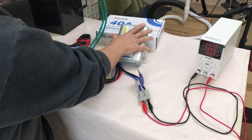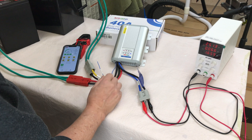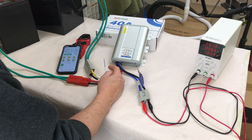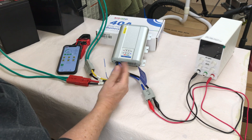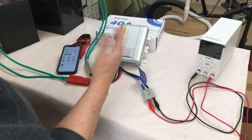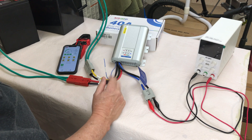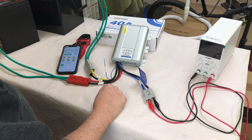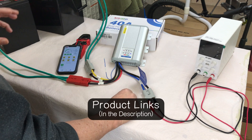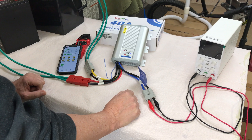Very cool device. I think it's very well built and very simple to connect and use. You just have to remember you're going to have to come up with your own wiring — that's probably the most difficult part. But they do give you the Anderson connectors; you'll just need a crimper, the wire, and some fuses. I think it would be real handy, and in some cases you wouldn't even have to have solar. Charge your house battery while you're traveling and your battery is topped off when you arrive. And if you had a couple of cloudy days with solar only, you could start your vehicle, go for a drive, and get your house battery topped up so you're not without power. I'll put links to all this in the description for those who want more information, and if you want to see another solar-related video, click the video on screen now.